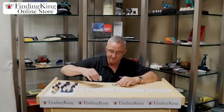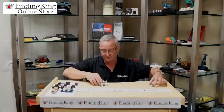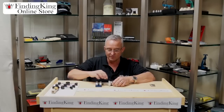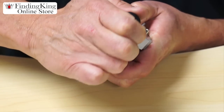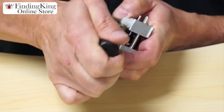Simple to use. The back will look like this on a Rolex. Insert it into the vise — you have two types: you can bench mount this one so it doesn't move, or you can have one that's loose also like this. Put the tool on the back of it, press it, and give it a turn until you get it loose.